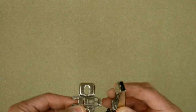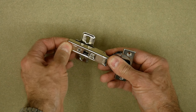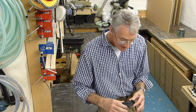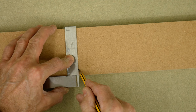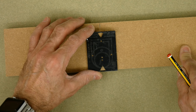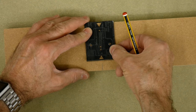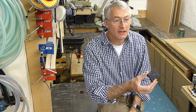It's a standard cruciform pressed steel type of hinge plate, and there's enough adjustment in there to get you out of a slightly skewy carcass, because life happens. Before I built my little jig to go on the drill press, I used a little template like this — a really simple little drilling guide, a couple of pounds or three dollars off eBay or Amazon. They give you the hinge centre so you can use a regular hinge boring bit with a brad point, and also the two drilling points for the standard cruciform hinge plate.